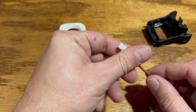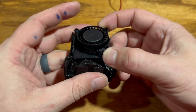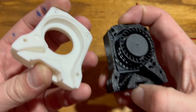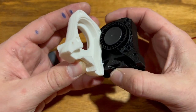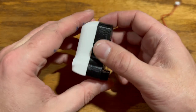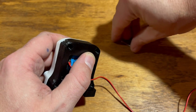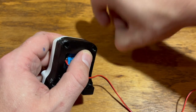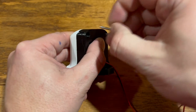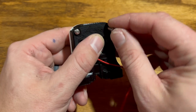Grab the end of the wire and put it through the rectangle. Make sure the blower part is blowing down and fit it right in there — it should slide in fairly nicely and easily. Then put the cover on. The cover has little countersunk holes for the fan, so it should snap together pretty nicely and be tight even without any screws. The first two screws we're going to put in are number four three-quarter inch screws — go ahead and screw those in on both of the top holes.